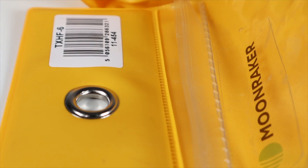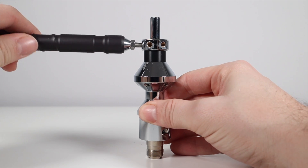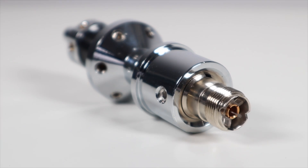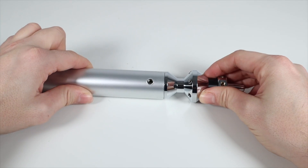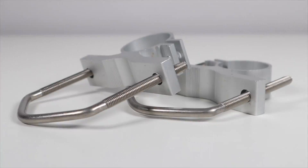Setup is really simple — everything comes in this bag along with instructions. The manual provided doesn't tell you in which order the radials have to go in, so you can screenshot this photo or download it from Moonraker's website, for which a completely non-affiliated link can be found in the description. The antenna radials simply screw into the top of the hub in the order shown, and each one is labelled so there's no confusion. The ground planes screw into the bottom of the hub, and there's just 3 of these. Your feeder connects to the SO239 connector on the bottom, and it can be attached to the mounting pole which is provided. In the bag are extra sections for the antenna radials which can be moved and swapped to achieve coverage on your desired bands, and there's also mounting brackets.